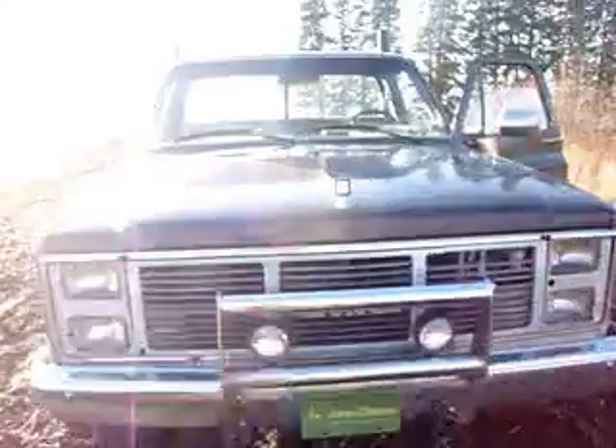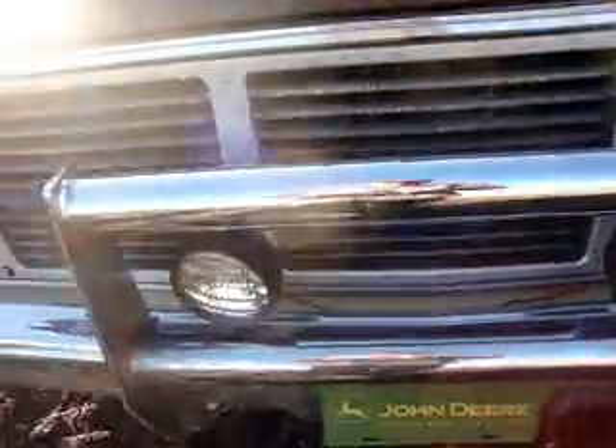And here's the new lights I put on. They're just regular tractor rubber-mounted lights. I wired them in so that they only come on with the high beams. Yeah, see? Click the high beams off and they go off. Click that.